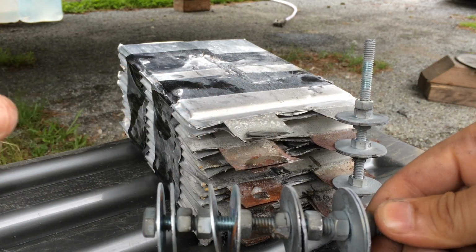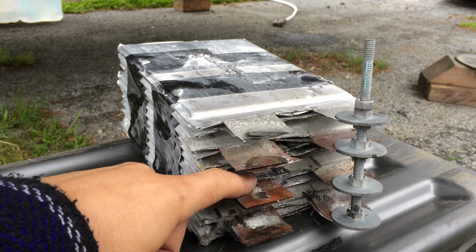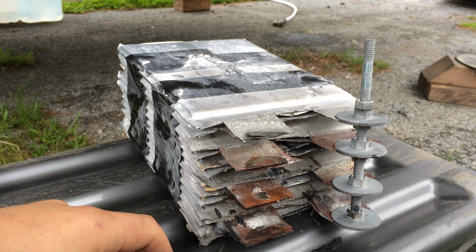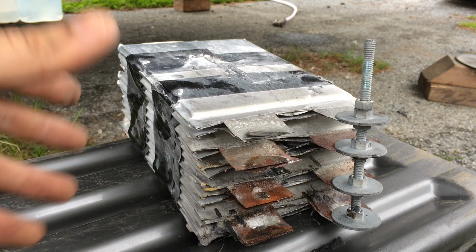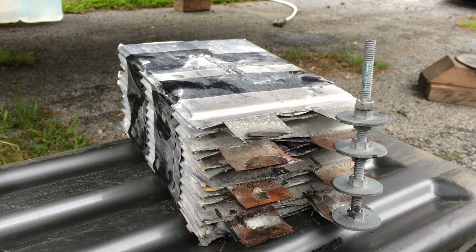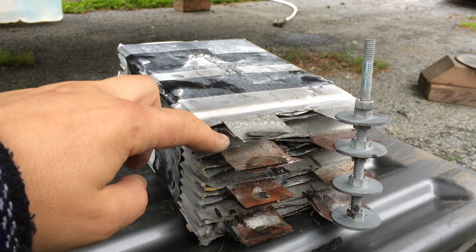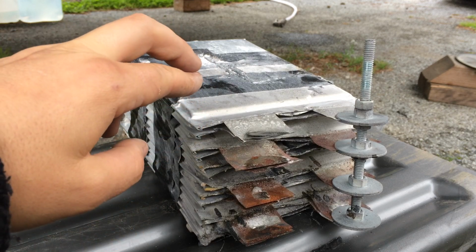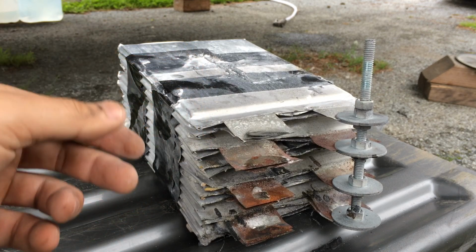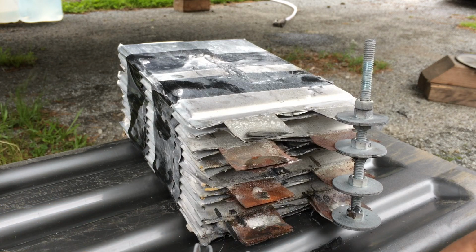Last time, if you saw my other video, you'll see that I had soldered them, and you can see some of the residual solder on there. But soldering is okay. I think if you've got a long series string, perhaps. But once you get more than two in parallel, then you're trying to solder three tabs together. Once you do the two on this one, the two on the next one, and then those together, once you get two or beyond, it's probably just not going to work. So this is a good solution.